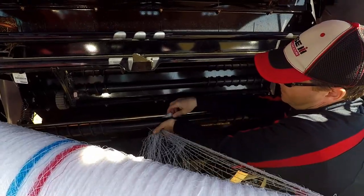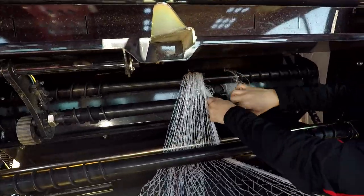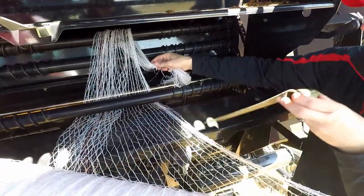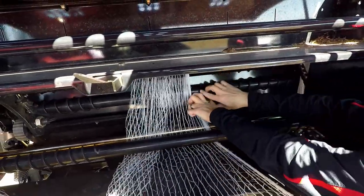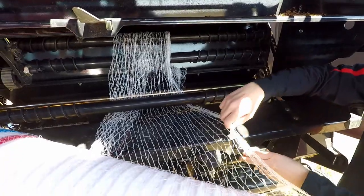We then use our diagram and we thread the net through our net spreading rolls, and we grab the net stuffer tool, and we stuff the net through the duckbill long enough to leave a tail for the turning bale to grab when we're in the net application process.